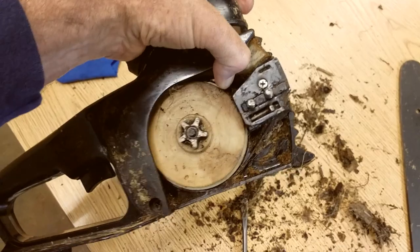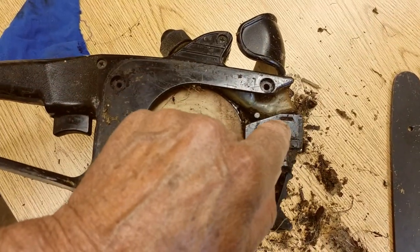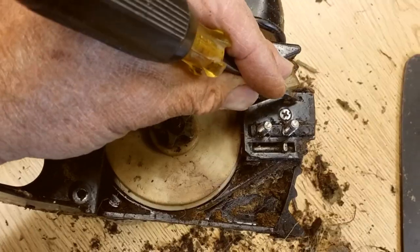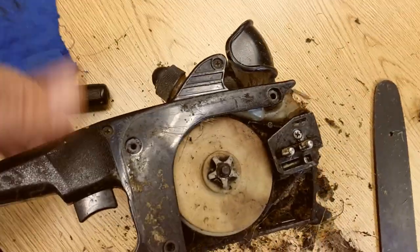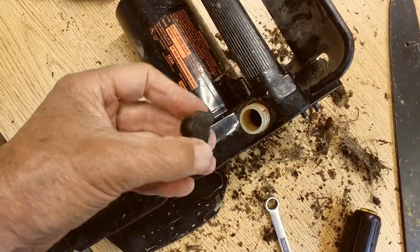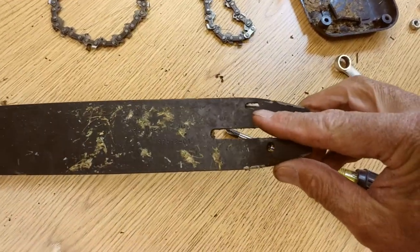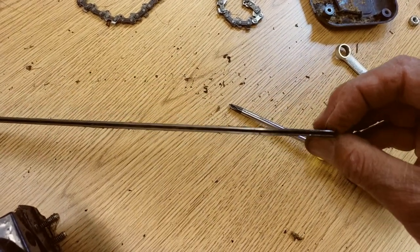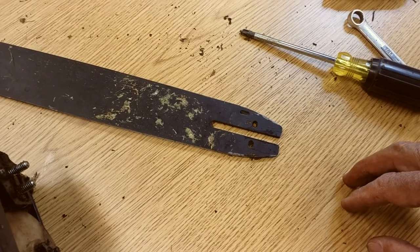It's pretty dirty there. You turn that screw and that is the bar adjustment because that drives the bar up and down here to tension the chain. That slot right there is where my oil reservoir feeds the chain and the bar, and that was all full of goo. I've got to clean the whole bar out. Before I take this apart, I'm going to go to work on this chain because I'm going to soak it to get it clean. It's worth it once in a while to take your chains off and actually clean them.